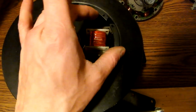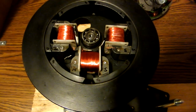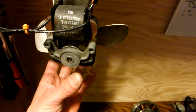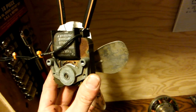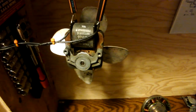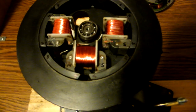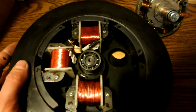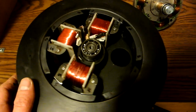I'm going to use three of these coils — they're 12 ohms each, so it'll be 36 ohms total, which is pretty decent. They actually came from bathroom fans. I was looking at these fans all the time, especially at the scrap metal recycling center where there's a ton of them. I got out the band saw, cut them up, and with a little grinding they fit perfectly. This is going to make a great Adams motor.